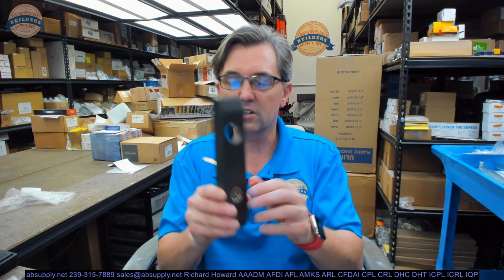Then you have the rim device, which is the 1786. That's number 2, and that's a rim device. So it's a typical looking panic device as a rim. Then you've got the 1686, and that's the concealed vertical rod. So you can always figure out which one you have just by looking at it and then referring probably to the documentation to know, well, is that 16 or 1786? I always forget myself. This is for the 1786.